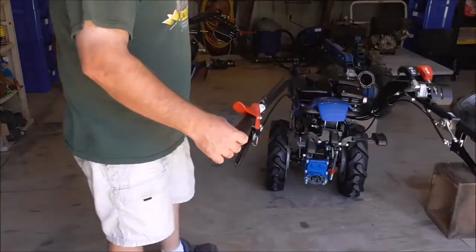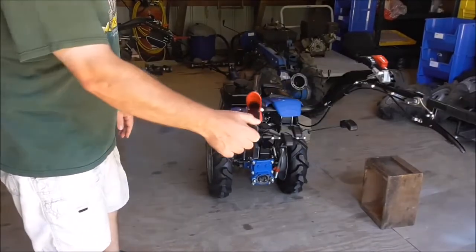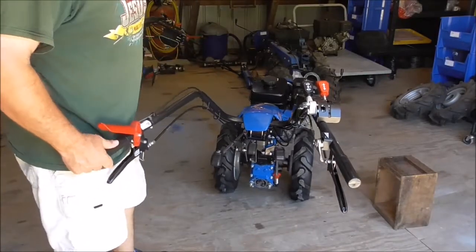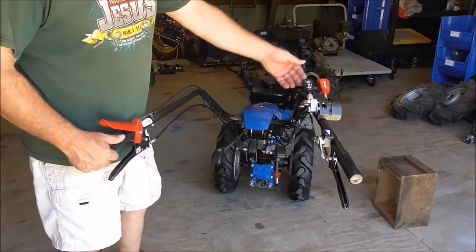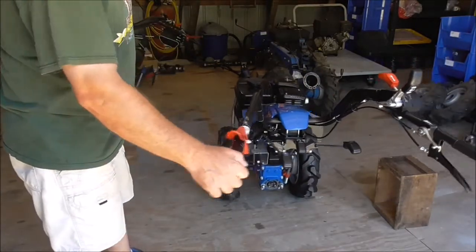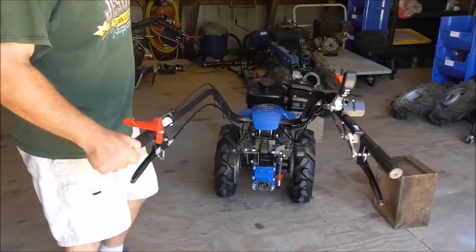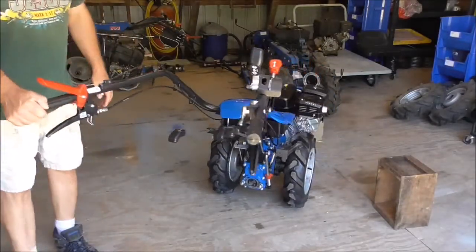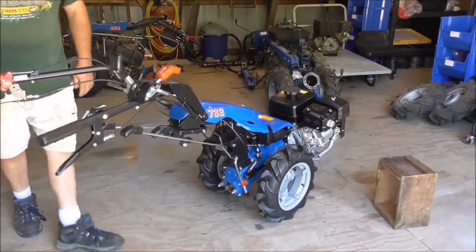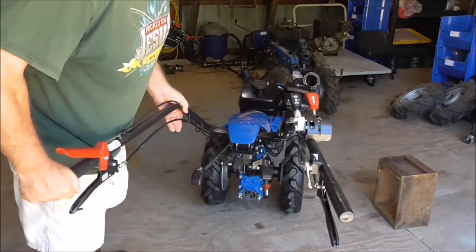The wheels spin independently of each other and it's a snap. If the tiller was on here, it would take a little muscle just to keep the tiller up off the ground, but not to turn it — it just turns wonderfully. Now, when you have a differential, what if you're in deeper soil and you need extra traction? No problem. You pull this lever back and it locks the differential. It's now locked in. If I want to turn the machine, I can, but just like any other straight axle machine, I've got to drag it around. The wheels are locked together, making it much harder to turn. So that's the differential.